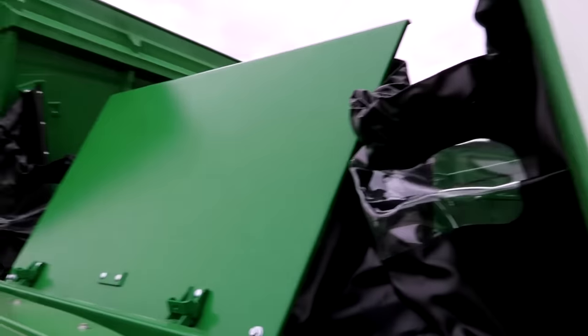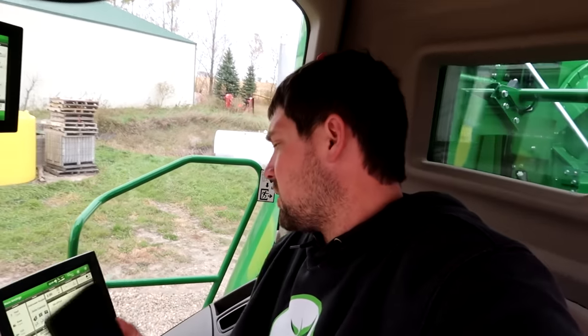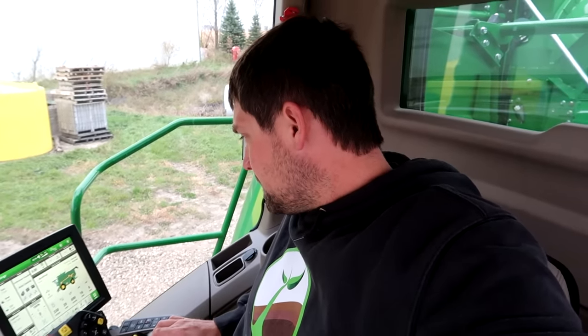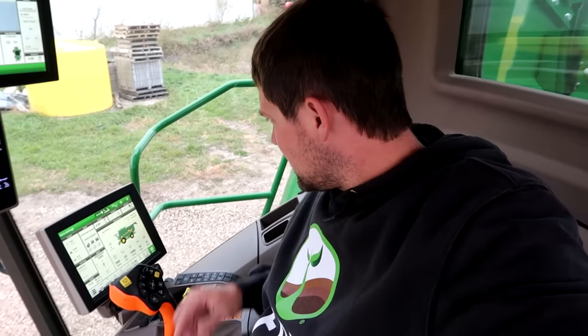Opening. Sweet — I've got all my settings set up, the outside covers are all closed. I used the GoHarvest app from Deere here on my phone to get the settings right. Here we go — let's start the back. I didn't hear any wrenches come out. Let's start it for a little longer. We're running — separator is running. Throttle up. We want our rotor and our fans set to about 600 and 900. So far nothing sounds like I broke it, so I'm going to hook a header to it and start that as well.